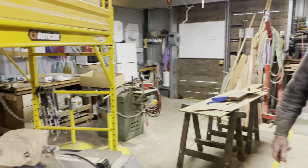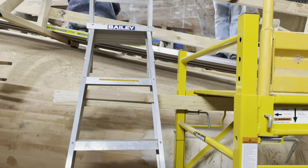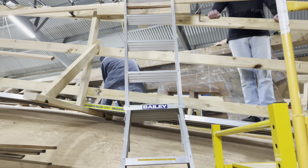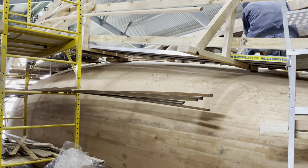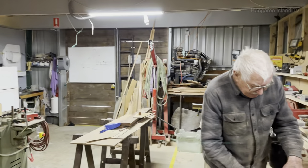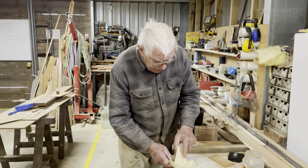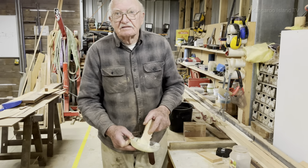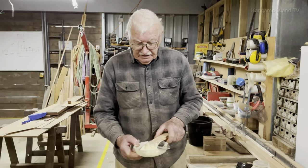So it's finishing off the planking on the inside of the hull. You've got the keel going — that's what you're working on at the moment? The keel's done, the deadwood's done. The intermediate break floors are done, so that we can put the laminated ribs in once we turn it over. We'll turn it over outside and then bring it back in on a dinker.